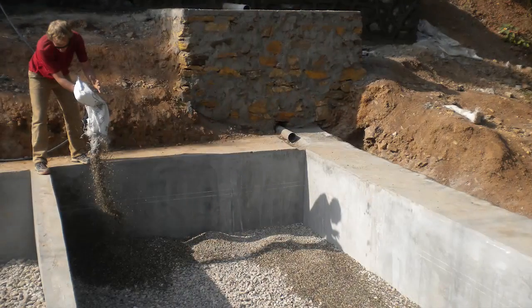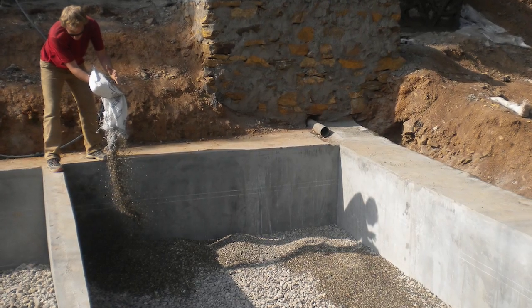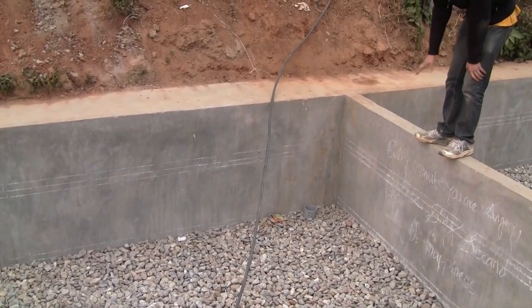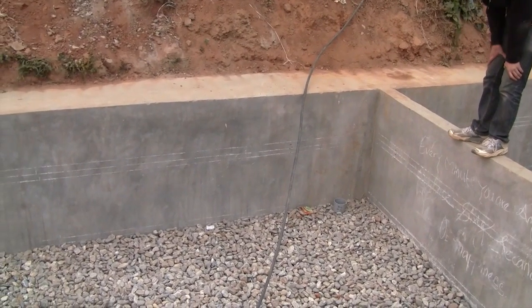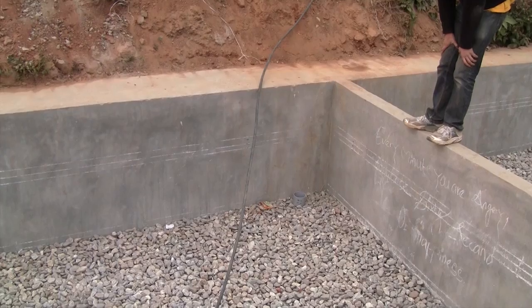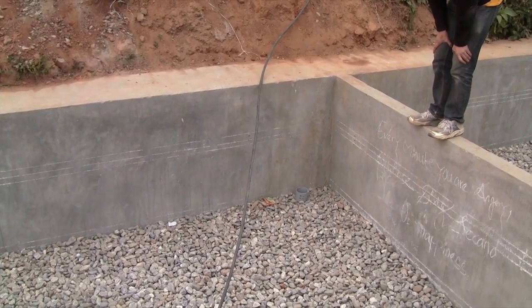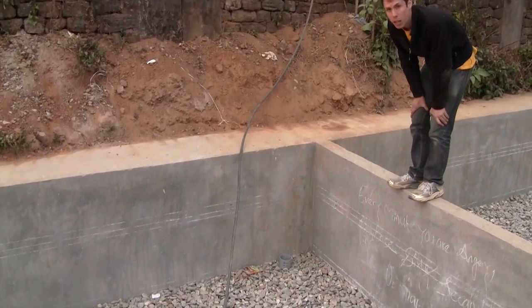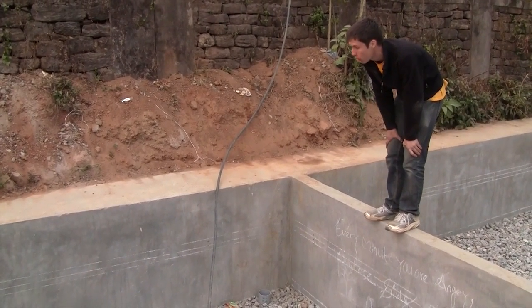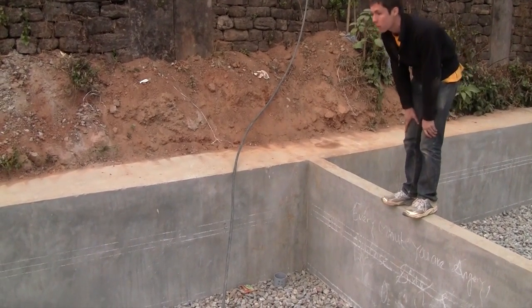And if you look into the bed so far, we're in the process of filling it at the moment. You have the drainage rock, which is about 15 centimeters from the bottom fill, and then after that we'll have a 5 centimeter transition layer, and then after that we plan to put 45 centimeters of treatment layer, which will actually do all the treatment of the waste water, and then after that there will be another 5 centimeters of transition.